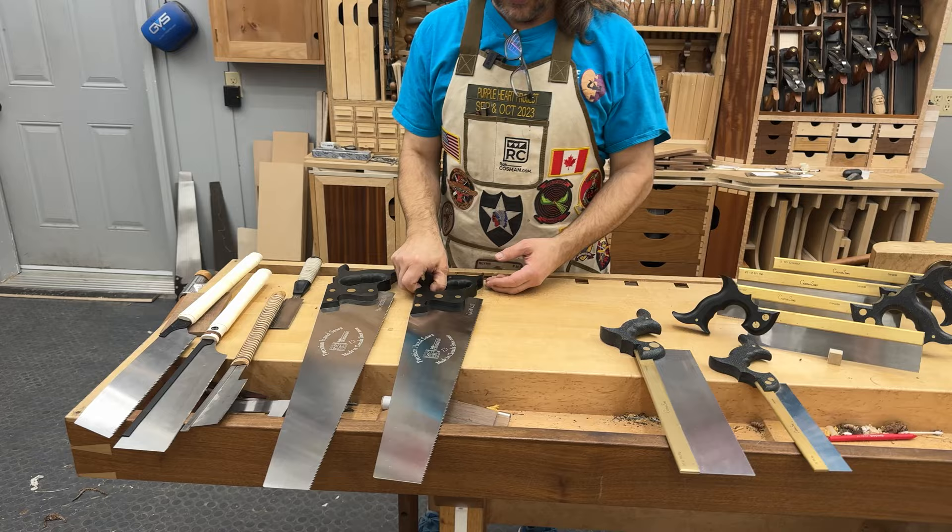You're also going to want what we call a joinery crosscut saw. This is a fine cutting saw — just two thousandths set per side — allowing you to cut whether it's the half-pin shoulder on a dovetail or the shoulders on a tenon, making a very precise cut. Then we have what I'd call a standard tenon saw — great depth of cut, thicker blade, heavier brass back, 12 teeth per inch with starter teeth. The problem was it's a heavy saw designed for a big cut, and students never developed real stability in their wrist with it — more capacity than they really need.